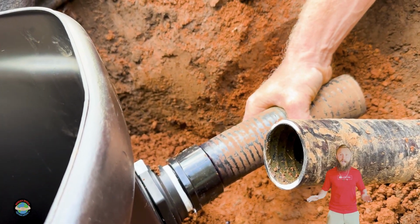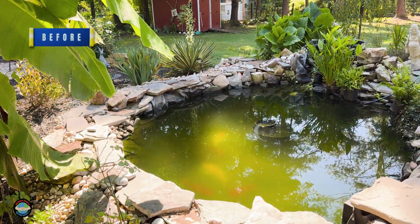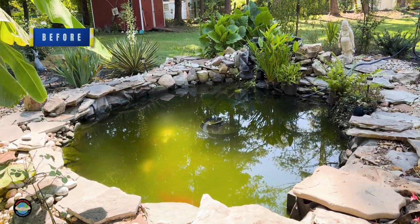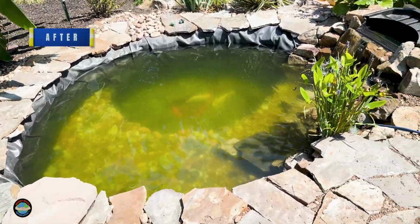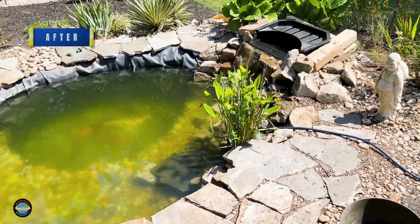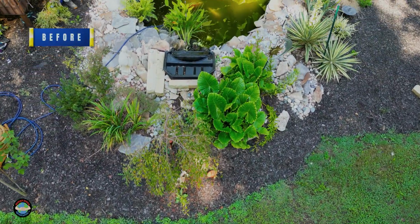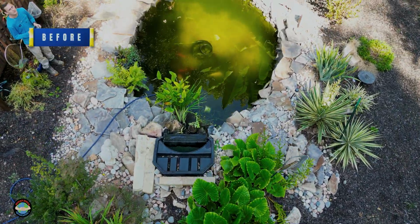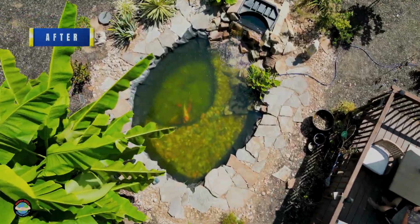There's no more leak happening. The pond held water or reservoir. The stream held water when bypassing your plumbing. So that tells us right then, the plumbing is the issue. But going back, let's say the pond held water or reservoir. The waterfall is still leaking after bypassing with the temporary plumbing line. This only leaves one thing left. There is a problem in the waterfall or in the stream area.